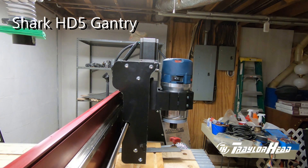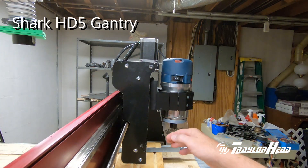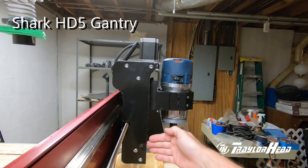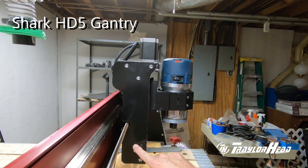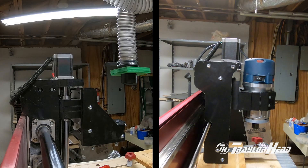This is achieved by your linear rails, which are fully supported across the back plane, and also your Z axis across its own back plane. Now it's time for slow motion — this is a side-by-side comparison of the flex in the gantries between the HD4 and HD5.